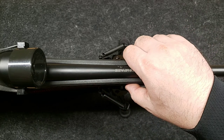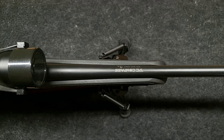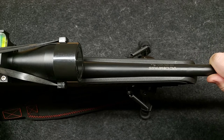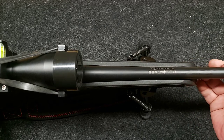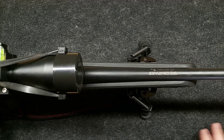We also need to add some kind of stiffener because the stock itself is pretty flimsy. Let me get the barreled receiver out of the stock and take a closer look. I've unscrewed the receiver from the stock, and this was the other issue I noticed earlier — when the action screws are undone, if you move the barrel forward and back, you'll actually hear it clicking in there. So I feel like we need to bed that. The receiver is loose on the lug itself, and when you fire this gun it could move backwards under recoil, and that little bit of play will open up our group.